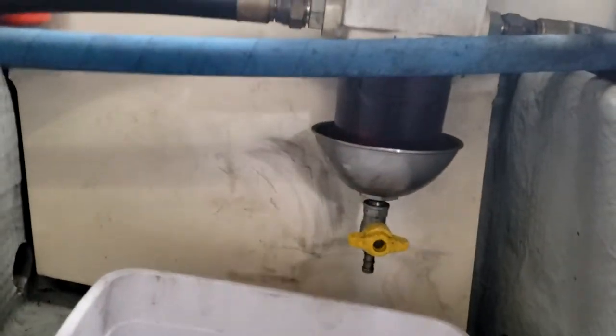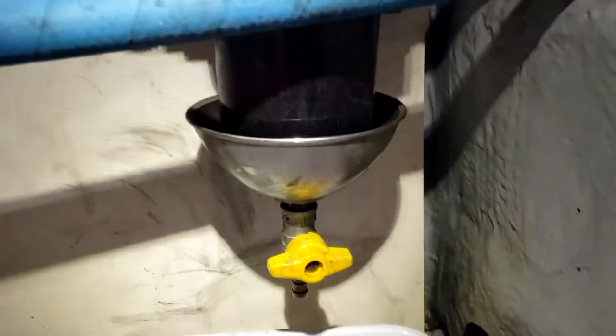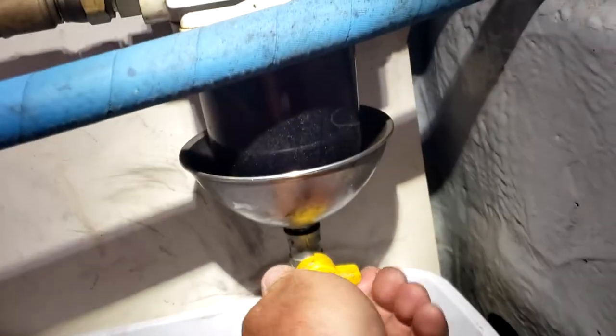So, you gotta turn off the fuel, which I did on the other side, and turn this one off too. That says pickup. So those both go to this. So I gotta turn both of those off. I'm gonna crack this and see how much crud and water. Yeah, that's water. All that orange, yellow stuff is water. Look at all that junk.